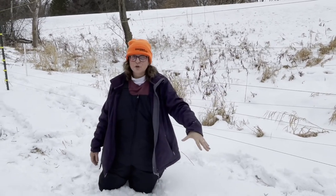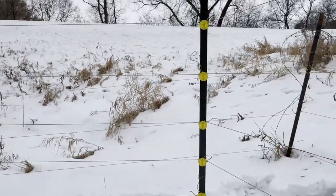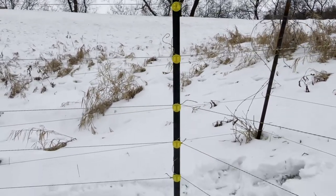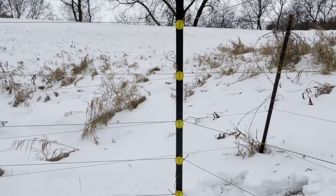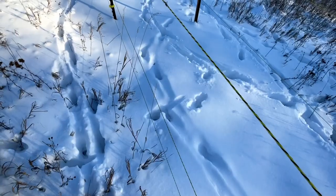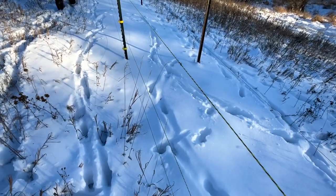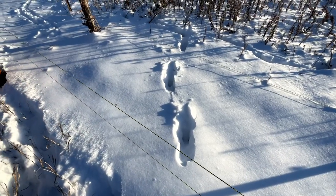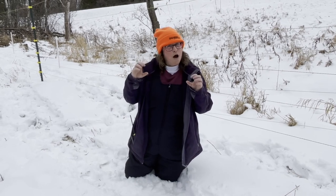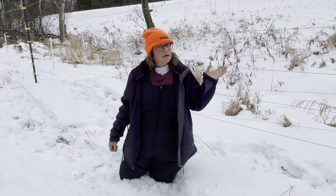Then the deer were just stepping through the inside fence wherever there was a gap of about 16 to 18 inches. We had the bottom wire, then the third, then the fifth — and now we've added the second and fourth rows, so they're closer together, about eight inches apart. We also saw that in some places the deer were squeezing underneath the barbed wire to get out, which gave us a sense of how close the wires need to be before the deer are deterred.